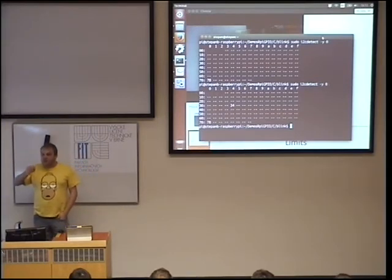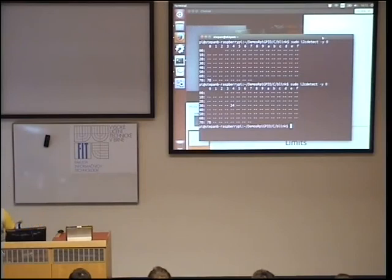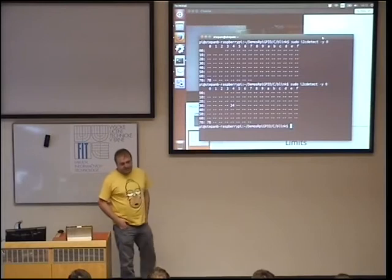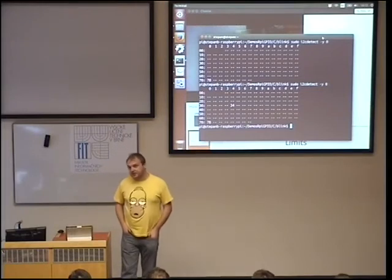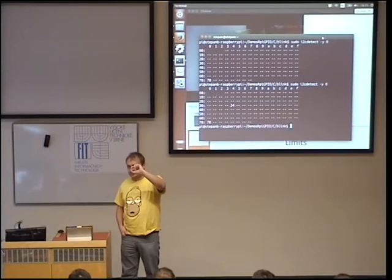So almost every device on the I2C bus behaves like an EEPROM memory. So how does the device get the number assigned? Typically you will find it in data sheets. For example, if you buy an EEPROM memory for I2C, there is a predefined address, it's hard-coded.